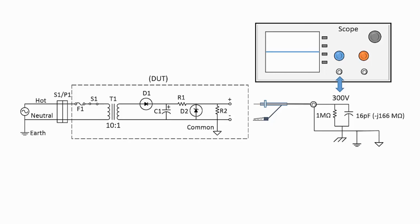A common, very powerful test instrument, and definitely one of my favorites, is the DC coupled oscilloscope. Most bench scopes have an input reference lead, shown here terminated in an alligator clip, connected to the earth ground. I checked one of my scopes, and the input at the BNC connector shows 1 megohm shunted by 16 picofarads with a maximum input voltage of 300 volts. Note that the scope's chassis, earth, and common grounds may be connected together at some point.